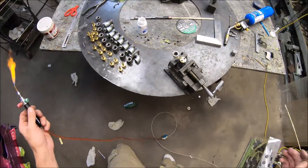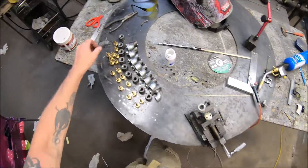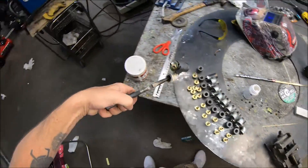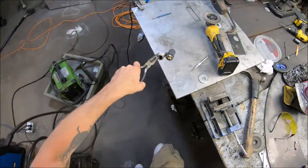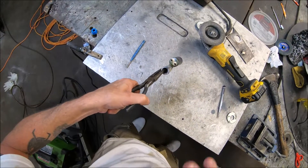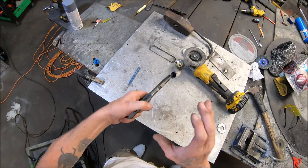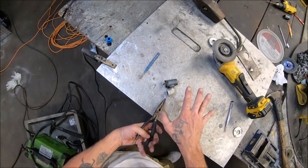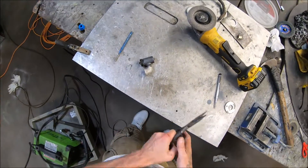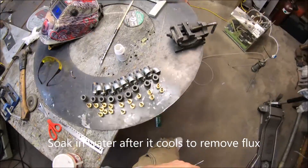Okay, that looks good — I've got to do that eight more times. Setting that on the old aluminum tray there. They recommend spraying it now to get the flux off, but this is a dissimilar metal and I ain't gonna do that. You do not want to be messing around with heavy expansion and contraction with dissimilar metal joints — it will crack and separate. I've seen a lot of that in my day.